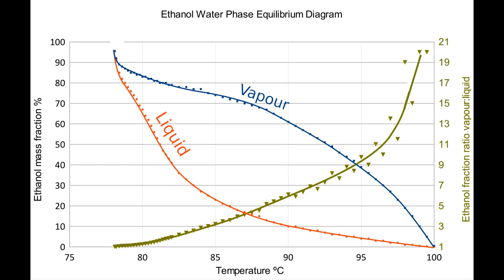This leads to the paradoxical observation that both the hearts and the heads get less headsy with higher column top temperatures — a bit like when a Scotsman moves to England, he raises the average IQ of both countries. In short, the higher the temperature the cleaner the product, but the lower the yield, because the more ethanol is lost to heads.